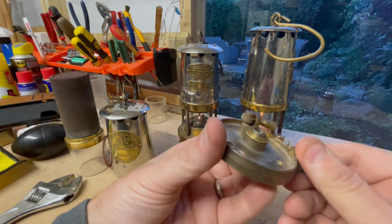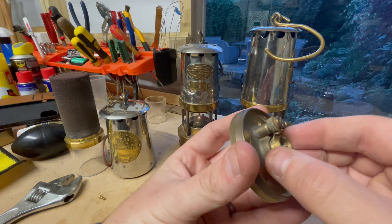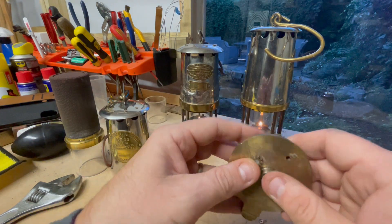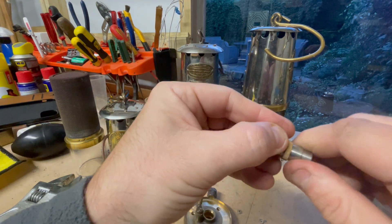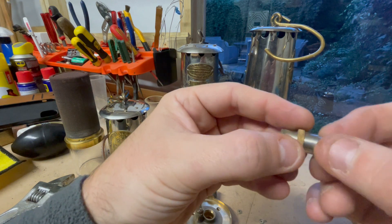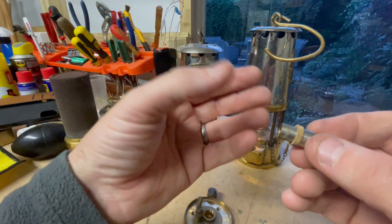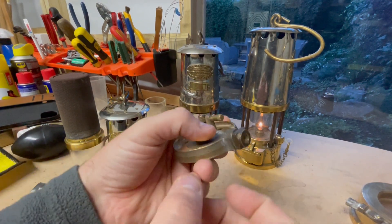This little glass plate unscrews, and there's a little rubber O-ring that should come off as well, and then this tube should just push out. So this is the stainless steel tube, and there's a bronze sintered ring there. The thing about a sintered ring is that it acts as a filter and a flame retarder — I'll tell you why the flame retarder works in a minute.